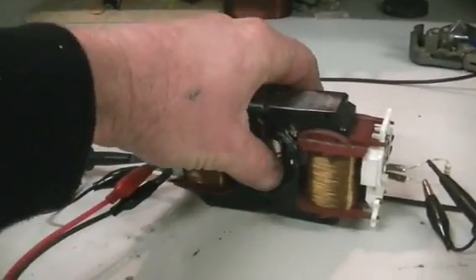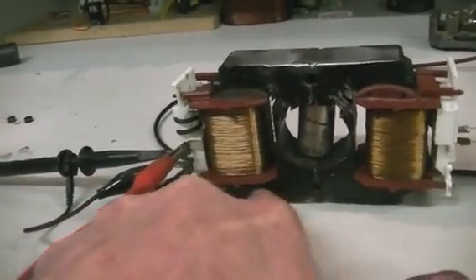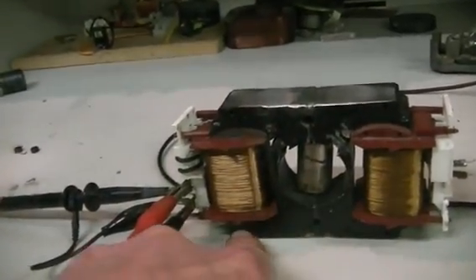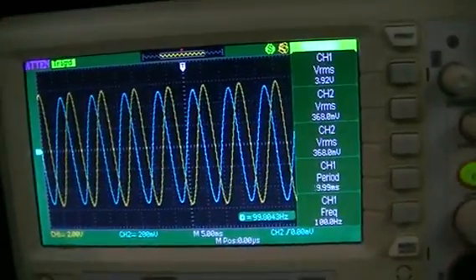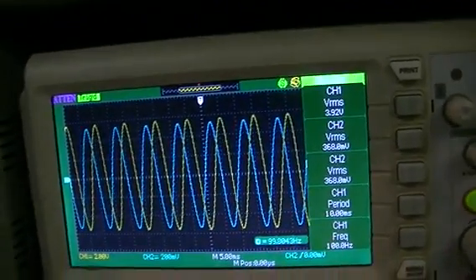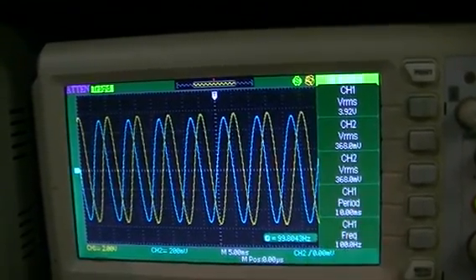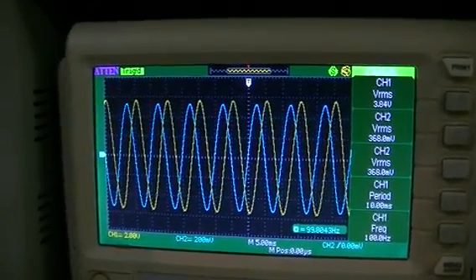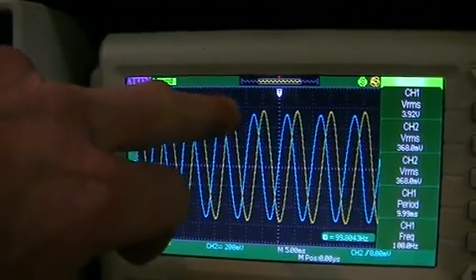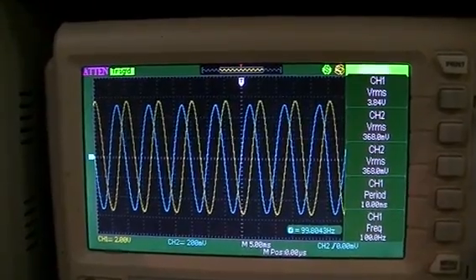However, what happened was not that at all — and that magnet is extremely strong. So our magnet is sitting in there now. The bottom half of this core, which is one full loop — it's most like a toroid — the bottom half will be one field of that magnet and the top half is the other field. What we see happen here now, our input voltage hasn't changed, but the output across our 100 ohm resistor has now gone up to 368 millivolts. And if you look carefully at the waveform on the blue channel, for some reason there is no offset or no biasing of the core.